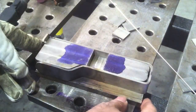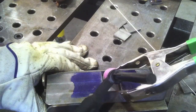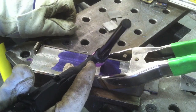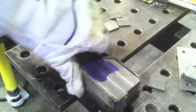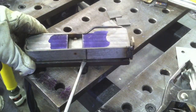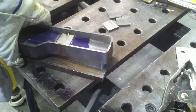Once all the tabs with holes are in place, the next thing is this little spacer stiffener, which gets welded on both sides. That's the main reason for the big cup — I can extend the electrode way out and get down in there and still see. I could use a smaller cup but you wouldn't be able to see anything. I'll get a couple of very small fusion tacks on each side just to locate it and hold it. Now, I decided to pry this thing off the fixture before welding it all out — and it's a good thing, because with only two little fusion tacks it had already tightened up significantly on the fixture.